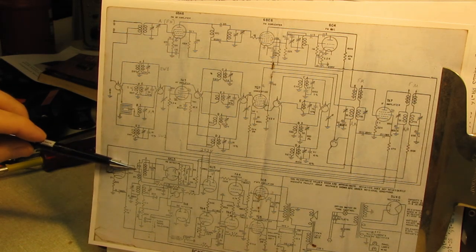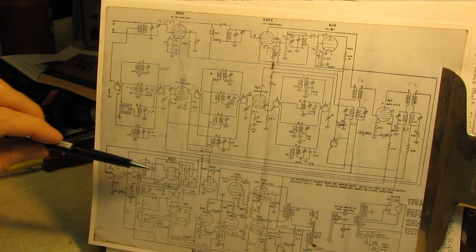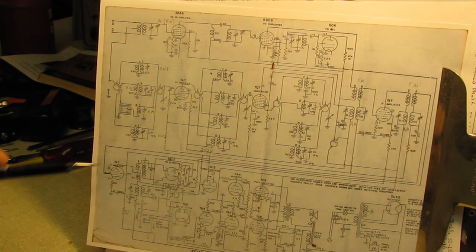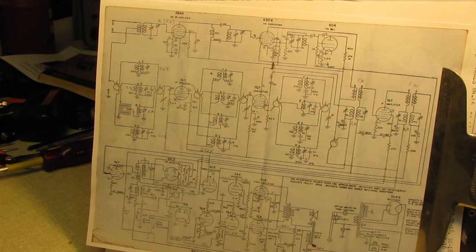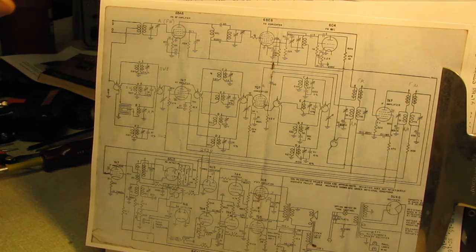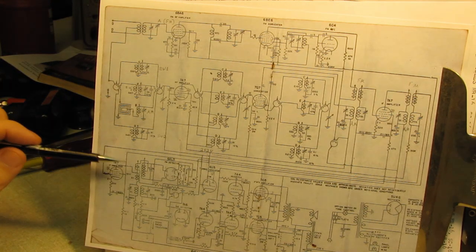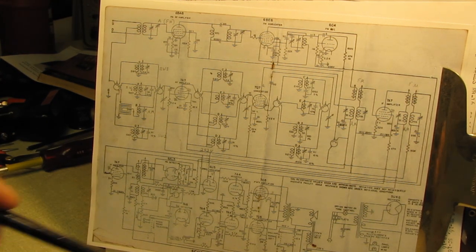And you tune the primary for max signal, and then you tune this for minimum voltage across the discriminator slash ratio detector. And Dave Tipton just did one of these. I'm going to use that same process. But now we have one, two, three, four, five, and six slugs moving. We should be able to go ahead and do the alignment.